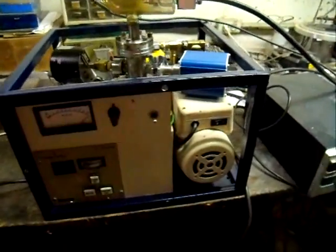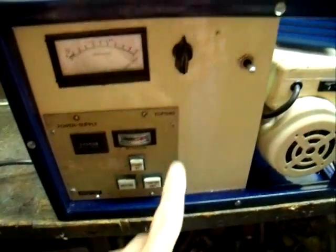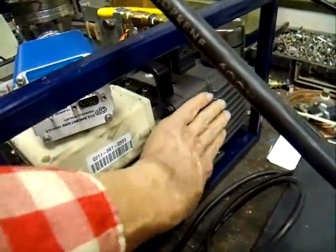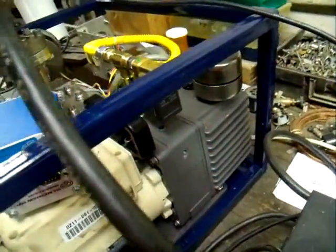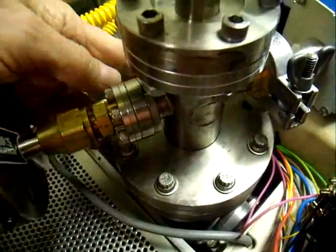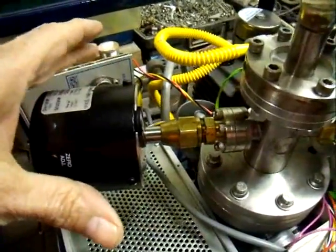Here's our vacuum system built up using a turbo pump. The total width is 16 inches and the depth is 15 inches. We've got a vacuum gauge, the controller for the turbo pump, a switch that sets the range for the gauge, and the main power switch. We have a small two-stage rotary pump for backing the turbo pump — three and a half cubic feet per minute, available on eBay for about $130. The turbo pump is mounted on the base with a flange on top, and we have two branches coming off the flange for gauges: a Baratron gauge to measure backing pressure and tell us when we're ready to turn on the turbo pump.